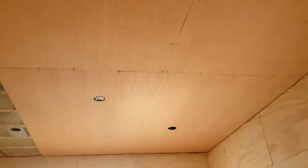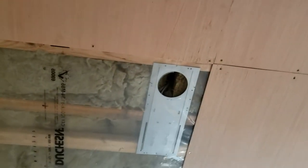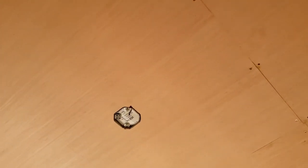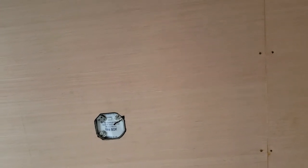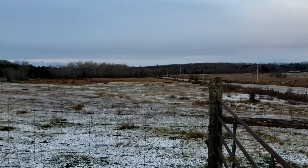Along all the edges and at the eight-foot mark all the way across, that covered every joint and every seam. Then at the four-foot mark we went across the opposite direction, and you end up with a picture-frame pattern four feet by four feet all the way along the ceiling. Then you paint everything the same color - that's what we did - and it came out really stunning. As for these electrical holes, cutting them with the Rotozip worked out perfectly and they lined up exactly right. We're cutting the plastic out beforehand now. It's a frosty morning with just a little snow here at the gateway.